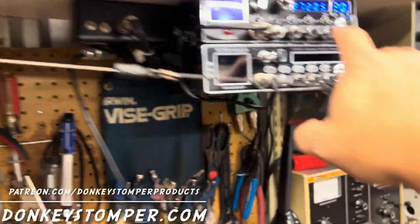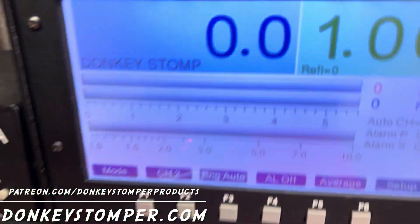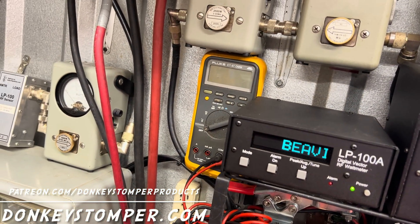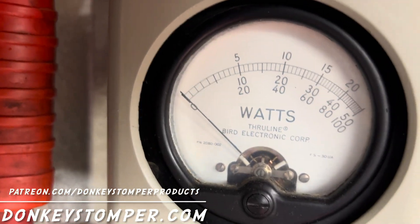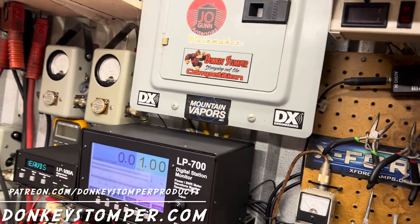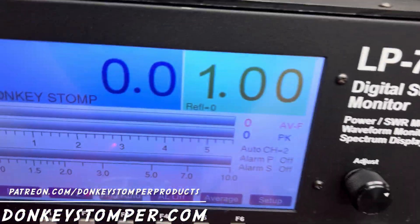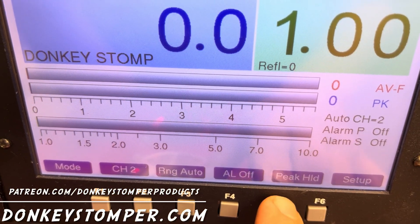I don't talk sideband, so I'm just gonna flip the radio to sideband — that's all I'm gonna do. Watch what happens — that's what happens to your HGs. I'm loading my power supply — you can hear the fan speed up. So the point I'm trying to make is you can't drive them as hard on sideband. Watch the average number, and whatever it does on AM average, you want to do about half that on sideband.